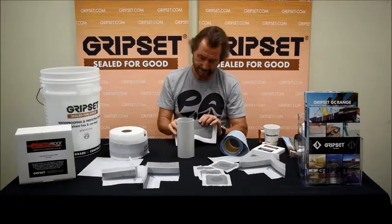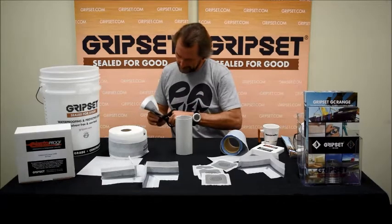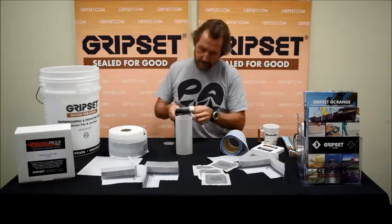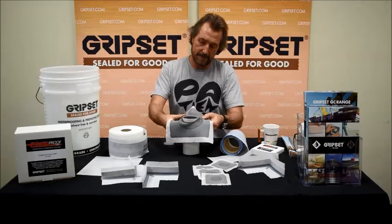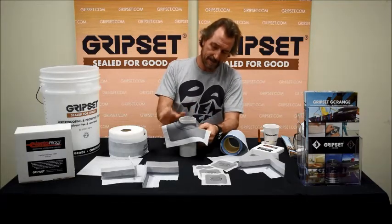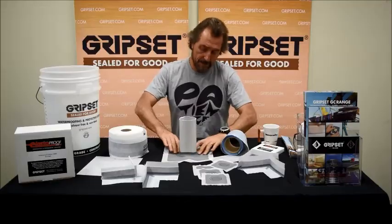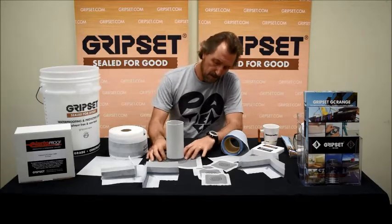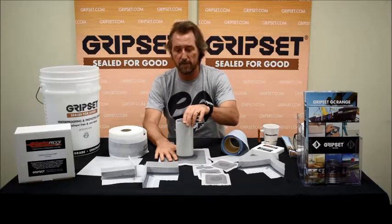The reason we have those circles is for guys like me who can't measure out too well — I just cut and fold to form a perfect circle, which is about 60 to 70 percent of the diameter of the pipe. I slide that over the pipe, and you can see that tight elastic seal. It slides down and gets wetted into the membrane. As you can see in the photo on screen now — the shower mixer being done — it forms a tight elastic seal around that pipe.